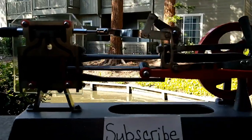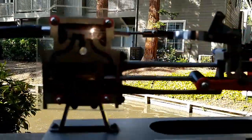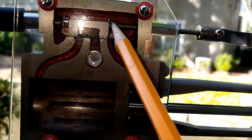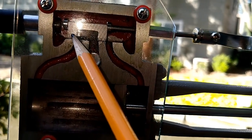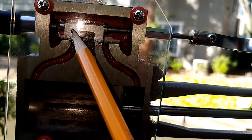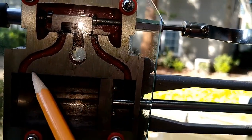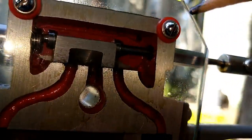Hello steam fans, this is my cutout model of a steam locomotive. You got your steam chest here - this area is the steam chest. For those of you who don't know, this is where steam first enters and is distributed to either the front side or the back side of the piston via a valve. This right here is a slide valve which slides back and forth, opening ports for admission and exhaust.